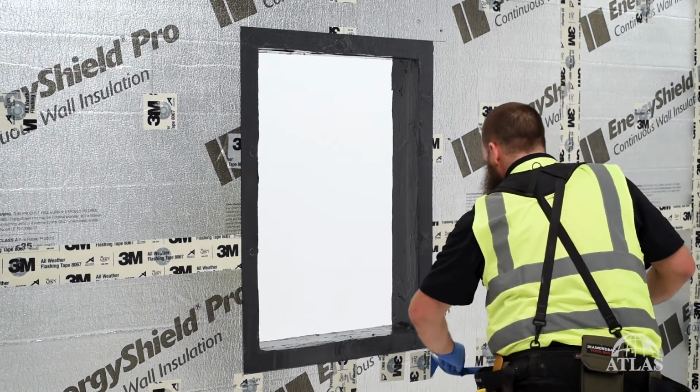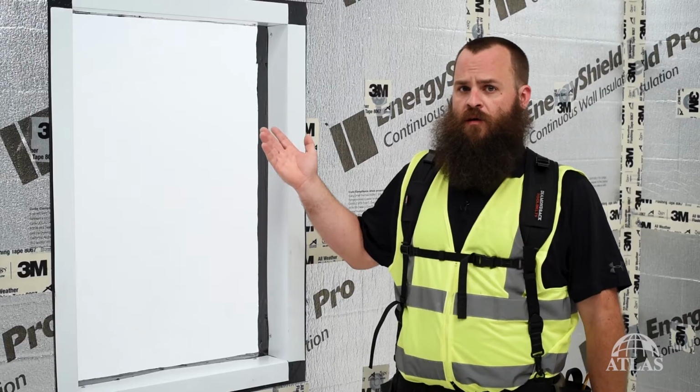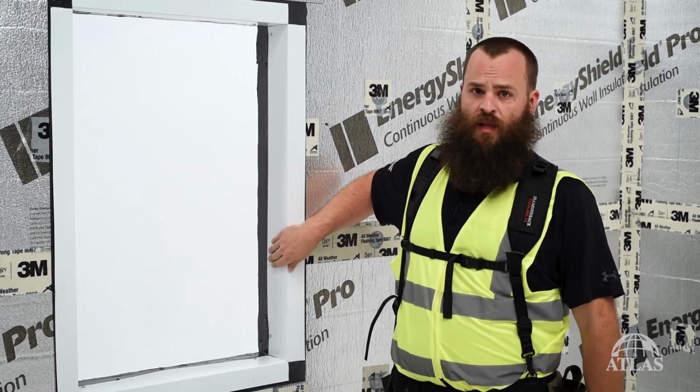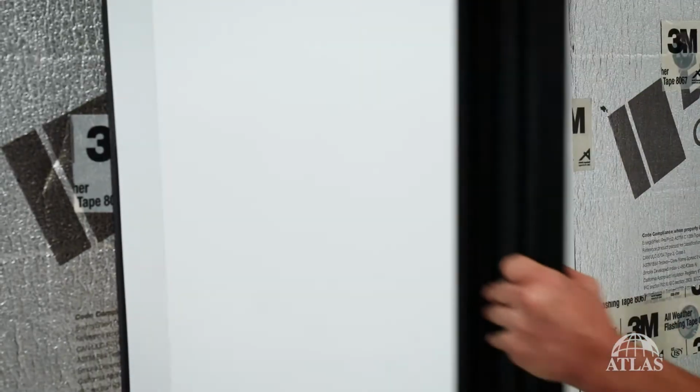So after liquid flashing your opening, it's prepped and waterproof and ready for a window install. The alternative method is that you can use a jamb liner. In this case, we've installed both as a belt and suspenders approach.